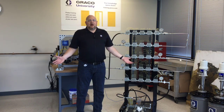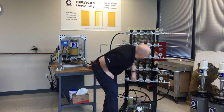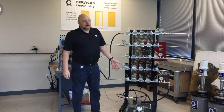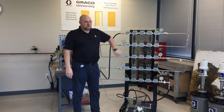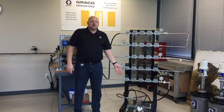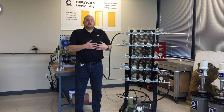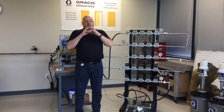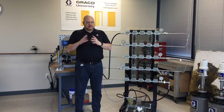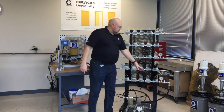This row has one left and this row is just starting to vent. Without the GL11s helping, we still have almost 500 psi right here. The reason having a GL1 or GL11 at the end of the line helps is because of grease shear — once grease gets moving, its viscosity drops. Grease has one viscosity when gelatinous but a much lower viscosity when flowing, so once you get that grease moving it's easier for injectors to reset.